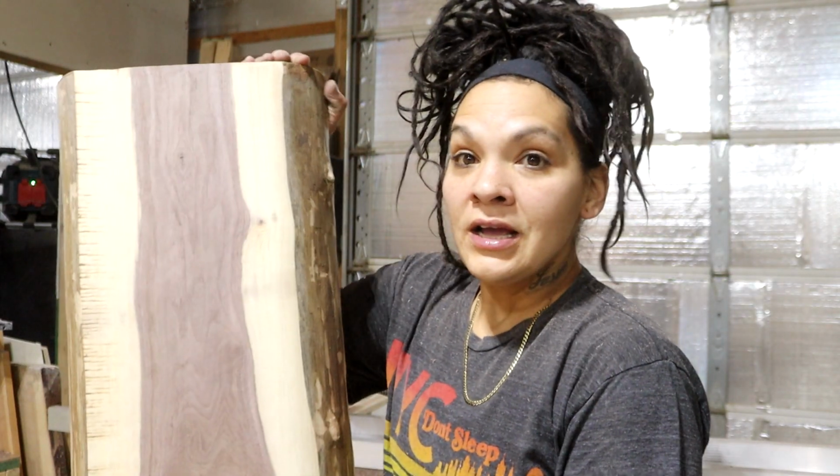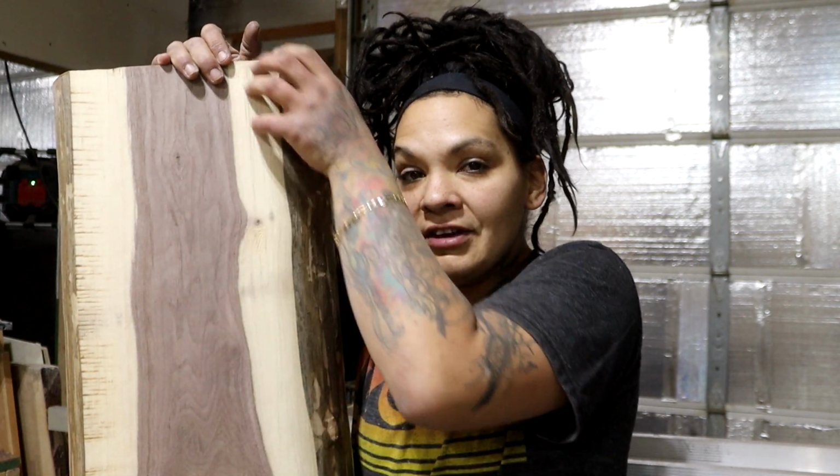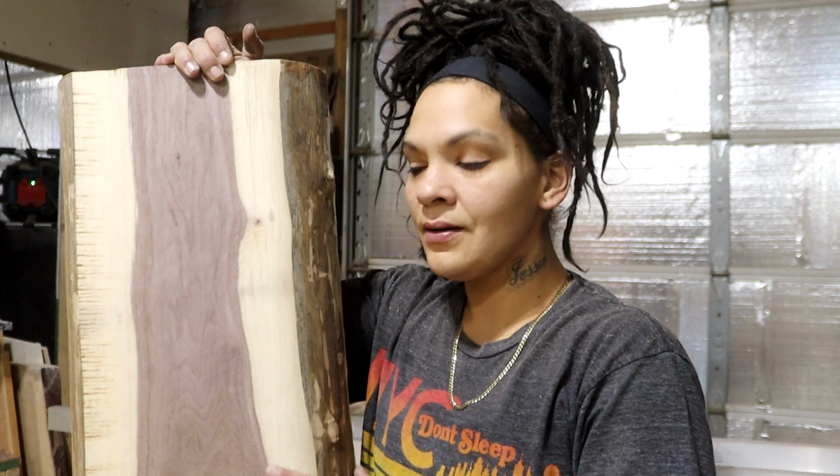But basically, four, five, six days later, I flattened my wood out, and then I poured it, and I saw it cupping. It wasn't bad, but I saw some things happening. When they dried it, they didn't dry it right. The moisture that was stuck inside, in the core of it, so everything out here was dry, the moisture was in here, and it dispersed out into the rest of the wood after time because it wasn't done right. So be careful with that as well.